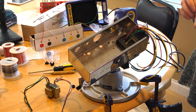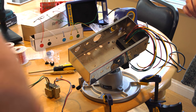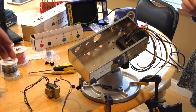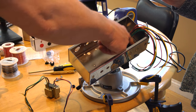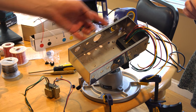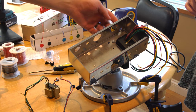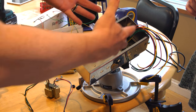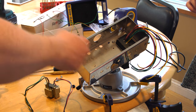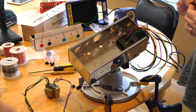Okay, so today we got our board done — we just quickly off camera drilled the holes we need for it. We'll put the board back in the chassis later, but we now need to prep the chassis. She's going to mount the output transformer, hook up the sockets, potentiometers, the light, the power switch, and then we'll solder and tie things together with the heaters and main power stuff before we drop the board in.